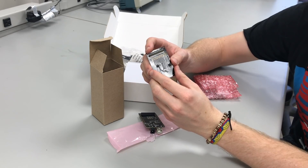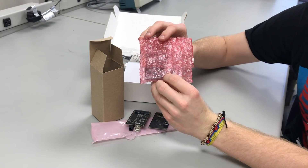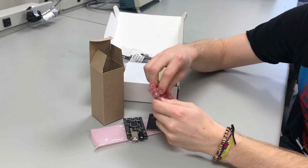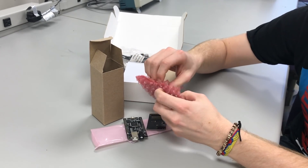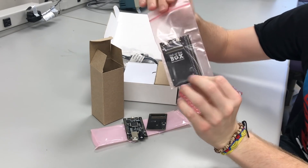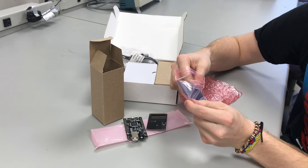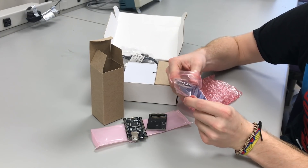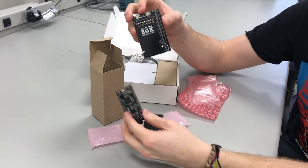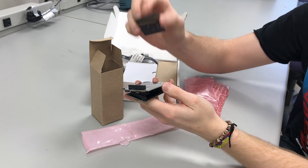In this same kit we have access to another sandwich board called the EBI Base Board, which connects between the Mupad and the Memory Base. This board allows us to give further signals so we can connect to more external components. This is the EBI Base Board, also called the EBIB. However, in future iterations, the Memory Base and the EBIB will be combined into one board. This connects to the bottom of the Mupad, and then the Memory Base connects onto the bottom of the EBIB, held together with spacers and screws.